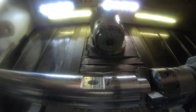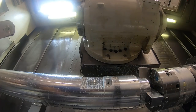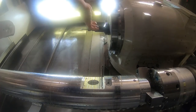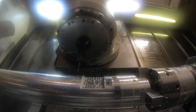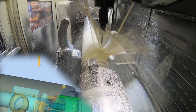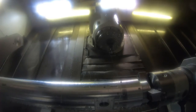And then now I'm going to come in with a little bit smaller drill, because two of the holes have a quarter inch ream in the bottom, so that's what this one is. I believe that's a D size, I don't know, it's 246 thousandths. I think that's a letter drill. I can't remember. And that's just to rough out the bottom of these two pockets, or these will be ports actually. And there's a quarter inch reamer. Unfortunately, I think I didn't take video of the reamer doing its thing a little later.